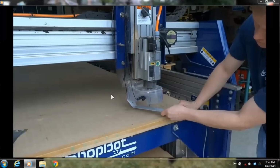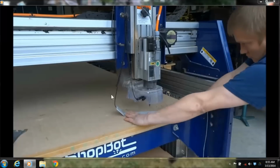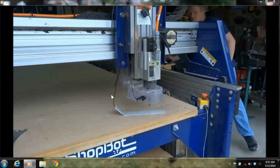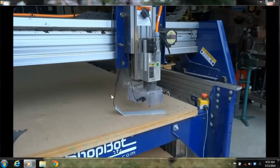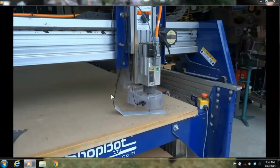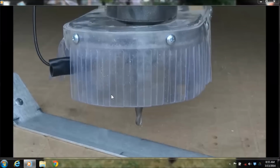And the first thing you want to do is check it. When you're touching this together, look over at your computer screen and make sure input 1 is turning green, coming on and off. And then just like before, this one has an icon that I can hit, which is click on the 1 icon, or I could type in C2, and it will go down twice and memorize that location. And now I know the distance between the tip of that bit and the table.